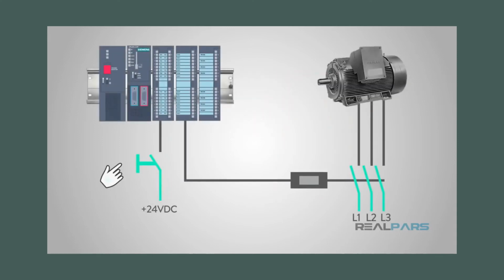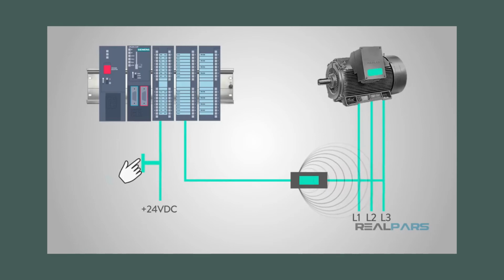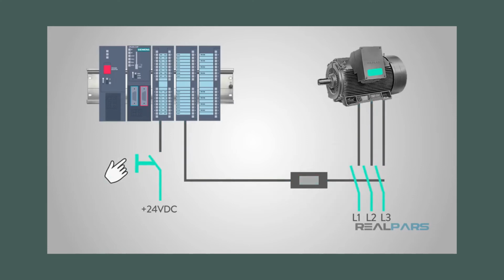In an industrial setting, relay systems are used regularly. One very common example is when an electric motor needs to be turned on and off. Commonly called contactors and motor starters, they are a prime example of a relay system. We use a low voltage, low current circuit for our motor controls. These can be push buttons or sensors that turn on the motor. In this case, we will use a photoelectric sensor to turn on a motor that runs a conveyor belt.